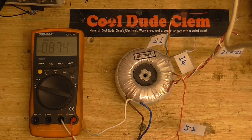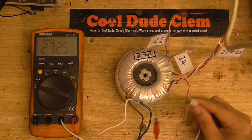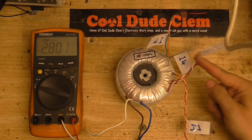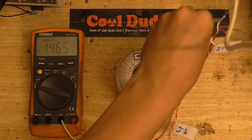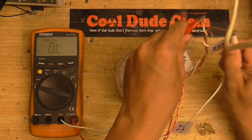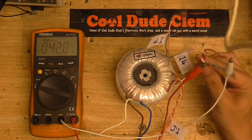Okay, so bring the old faulty meter in. Now I need to find out the phasing of these wires. I'm going to connect one of the multimeter wires to there. This is the 27-volt winding, so that should give us 27 volts when I click on to that — and yes we do. I'm just going to take this end and connect it to one of these wires here. Now I've forgotten which is the center tap on these wires, so I'm just going to measure that. I think the white wire is the center. If we get 21 volts, we'll know. Yeah, 21 volts. And this should give us about 42 — yep, 42.